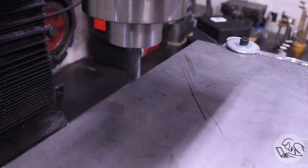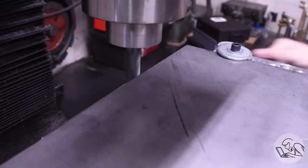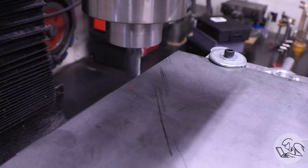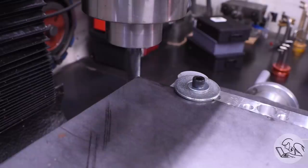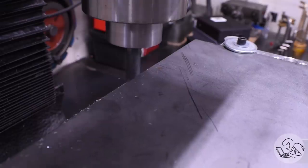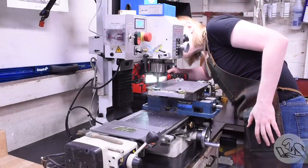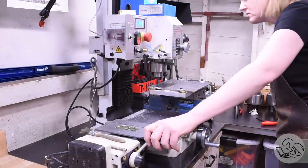On my drunken angle grinder cut it's pretty easy to see where the high spot is, so I'm touching the milling cutter off on that high spot, then I can move to one of the low spots and dial in my depth of cut. I'm doing 10 thou passes — nothing too crazy because this is pretty heavy steel plate, and this is a substantial pass even at 10 thou for my little mill in hot rolled steel plate. You always have to be extra careful on the first pass of a really rough edge like this. Once that first pass is done you can dial in depth of cut and just let the power feed run knowing nothing's going to dig in. These little machines can make big parts — you just have to be willing to be patient and do a lot of light passes.